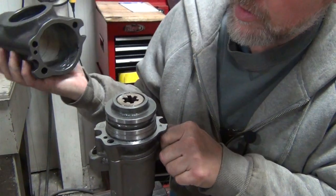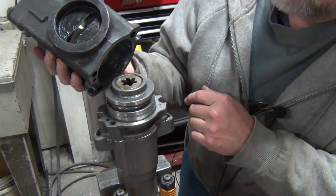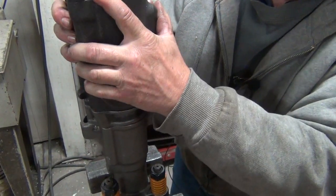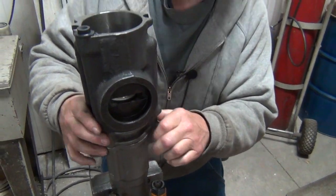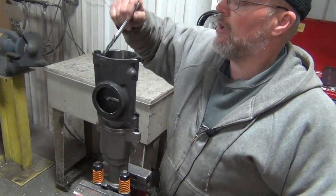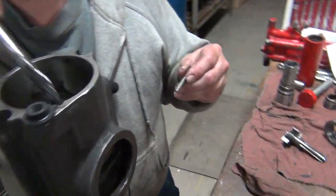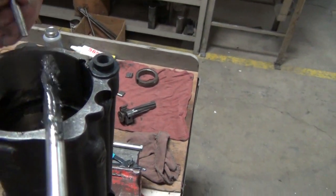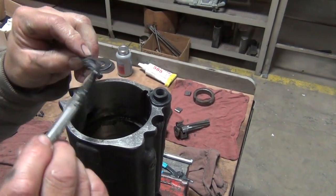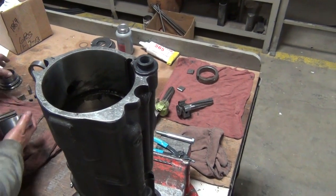When you go to put this together, make sure you assemble the drill with everything pointing as it should be — air holes, get all that to line up properly. Put a little grease on the machined area. There's a pin that sets down in here for alignment — you'll want to grease that groove for the alignment pin, because if that seizes in there from moisture, condensation, or anything, that'll hamper your ability to get it back apart.